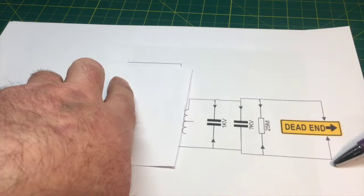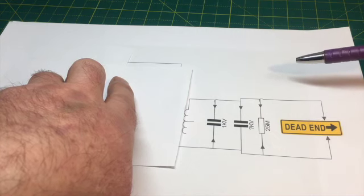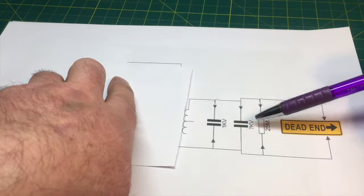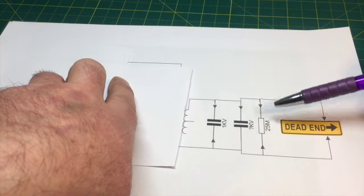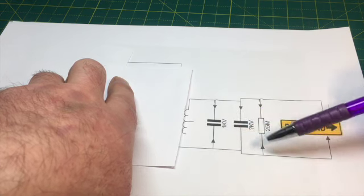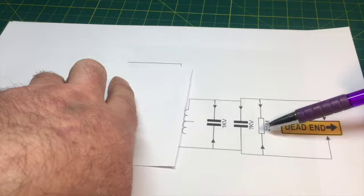And these are leading to an open circuit, which is completed when the fly completes the circuit inside the bat. So these get charged up to have a decent amount of voltage ready to discharge. And this big resistor here is for when you let go of the button. This will discharge these capacitors so that you don't give yourself a nip when the button isn't pressed.